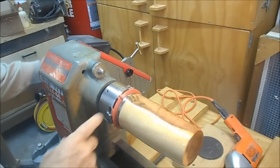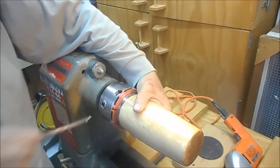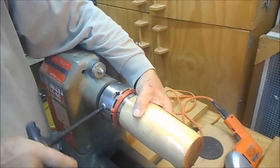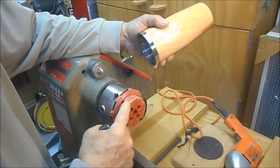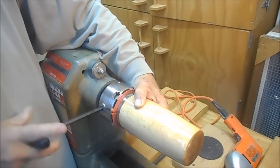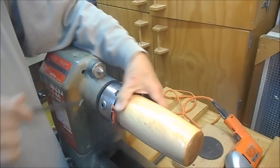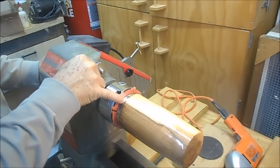All right, back here at the lathe, and remember, I just chucked it into my soft jaws. You know, take it back off. But these are the jaws Nova makes. They're some kind of soft plastic, so I just turned them down to fit the inside, and chuck it up. And all I'm concerned about is this little bit of stuff there and over here.